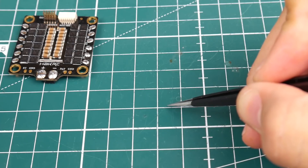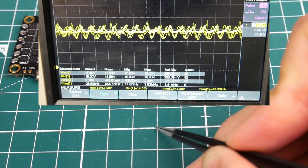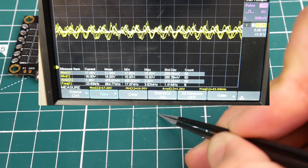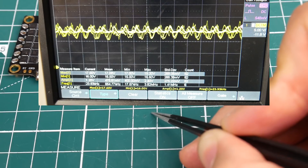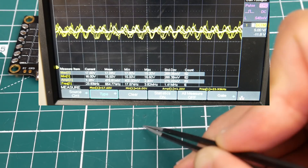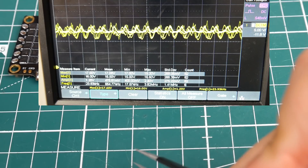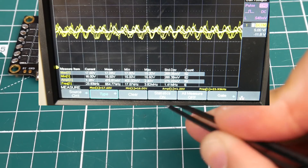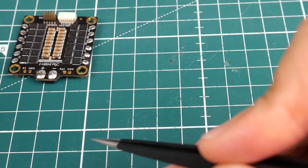Looking right dead in the middle of the trace, you can see a very solid line just going steadily — but you also see a little sharp line that's about to hit the five volt mark. That part right there is a voltage spike, an inrush of current, and that is the part we want to amplify. We could amplify this by around times two to be safe, so if it's going up around four volts, with two motors that could be a voltage spike of eight volts. That's still not bad, but that's only a theory — possibly best or worst case scenario, right in the middle.